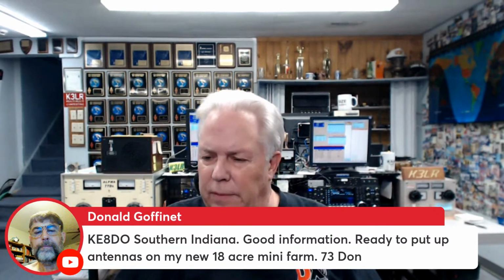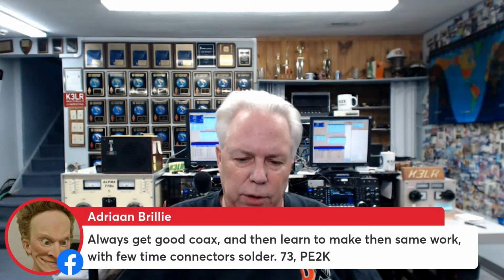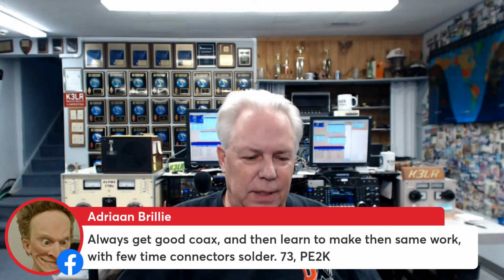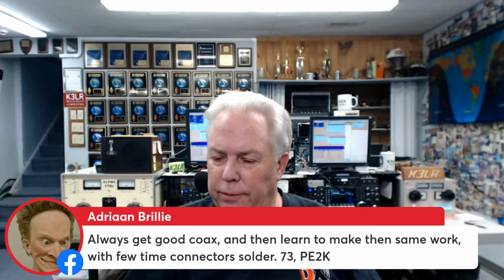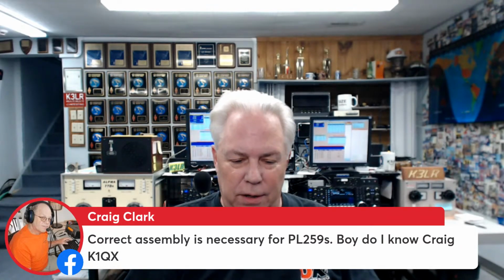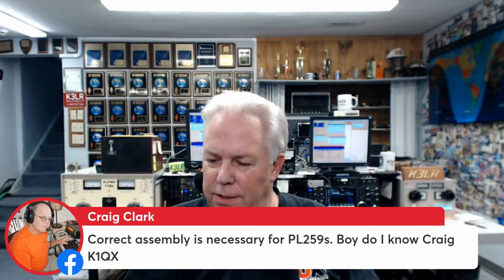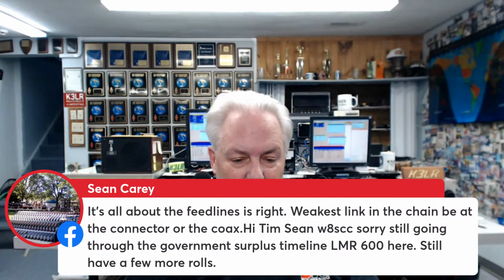And Adrian says, Papa Echo 2 Kilo, always get good coax and then learn to make them, same work with few-time connectors and solder. Getting that connector on is real important. And Craig, Kilo 1 Quebec X-ray, correct assembly is necessary for PL259s. Boy, do I know. And Sean says it's all about the feed lines. Weakest link in the chain, be it at the connector or the coax.